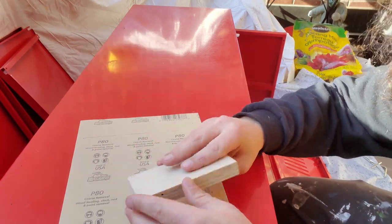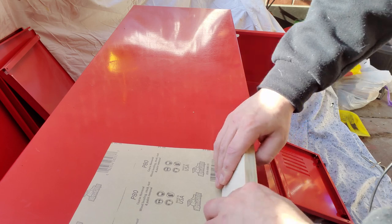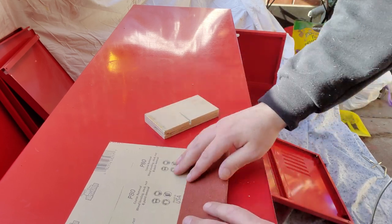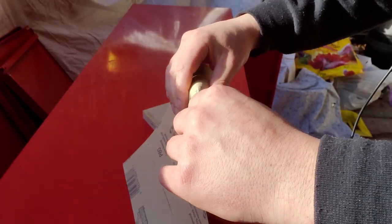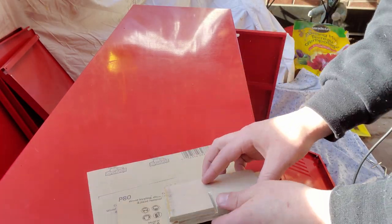I just have this sanding block cut off from the cabinet we made — having a block just makes it easier to sand. We're gonna try and get pretty much everything sanded. I'm not gonna take it apart anymore; we're just gonna get everything that's visible sanded down. I think we might paint it in a couple of steps — do everything we can see, let it dry, spin it, flip it to get the inside. Just make sure we get everything covered and don't get too much paint on anything, because the spray paint runs and when it runs it looks terrible.